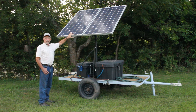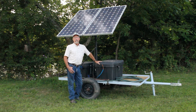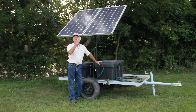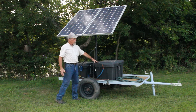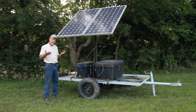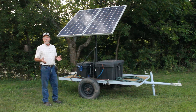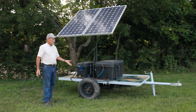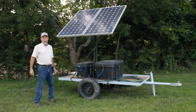The solar panels, which are 180 watts each, so it's a total of 360 watts of solar gathering capability. It has a box here that has the controllers for both the electricity coming from the solar panels to the batteries and from the batteries to the pump. And it has two 12-volt batteries in there. And then this box has a pressure tank and a pressure switch so that it pumps up, pressure reaches a certain point, and it cuts off and then cycles again and again, just like any traditional setup in a well where you have regular electricity. And the trailer.